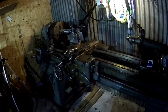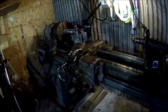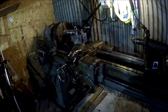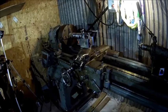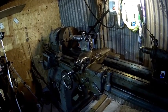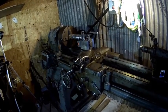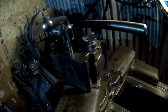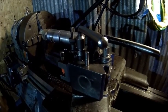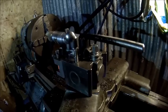It's making chips. We need to address the play on top and cross slide. I need to check the gibs - the gib screws are pretty loose, I don't know why that's the case. Maybe I just take it off and look at the spindle nuts. A little bit of work to do, but it's generally usable. Maybe not with stick out - I'm pretty sure if I use a center it's fine. The harmonics we're getting here are unbelievable. Maybe that tool holder is the issue - I prefer the multi-fix, it's just more rigid. But that's what it came with so we're gonna live with that for now.